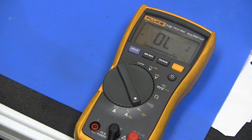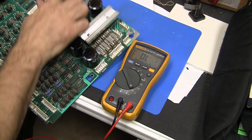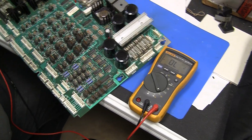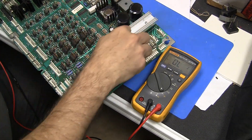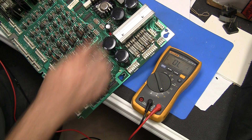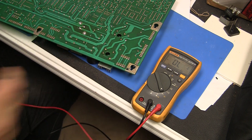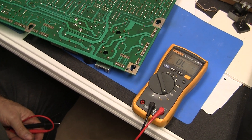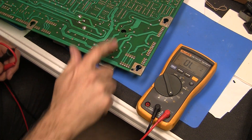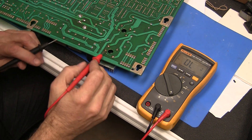Here's our power driver board from WPC gaming. You can see there are several different kinds of rectifiers here. You've got these two here, and there are two underneath here that have a heat sink on them because they probably handle more power and generate more heat. Let's flip the board over and look at where these are. So: rectifier here, rectifier here, rectifier here, rectifier here. You can spot the positive by looking at the one that's offset.